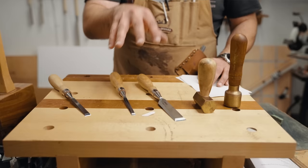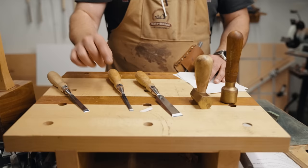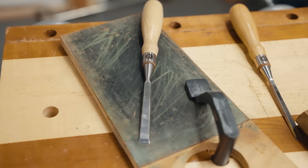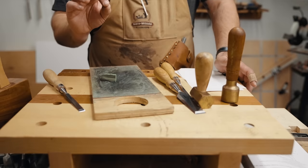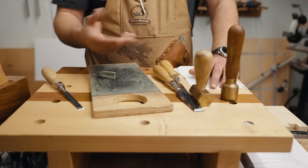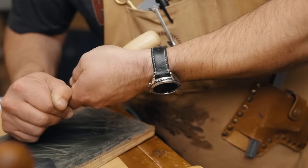This does not mean that you need to resharpen your chisels — I can't stress that enough. I don't sharpen that often because I have a couple of tricks that I use. The first one is a strop. When you do the paper test regularly, that's so great because it lets you fix things before you have to completely resharpen. I probably resharpen every couple of months, but I strop every time — or I use my buffer every time.